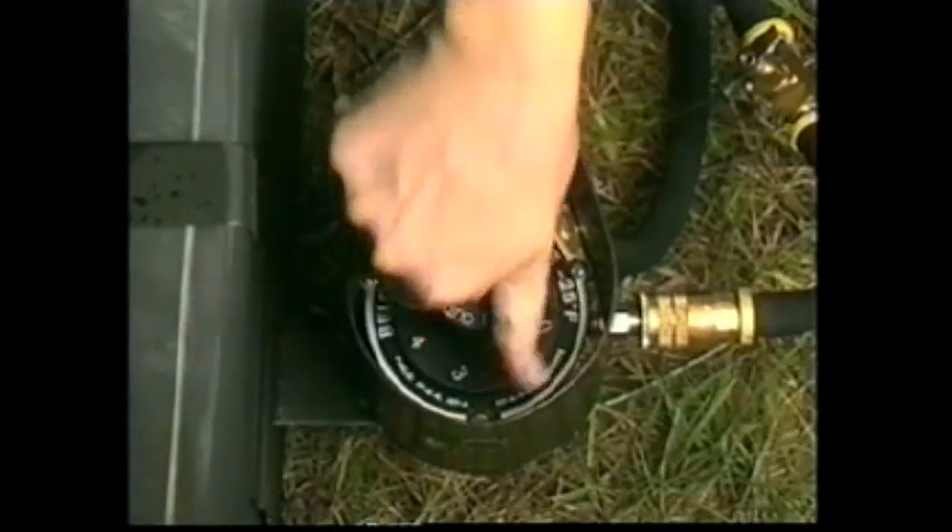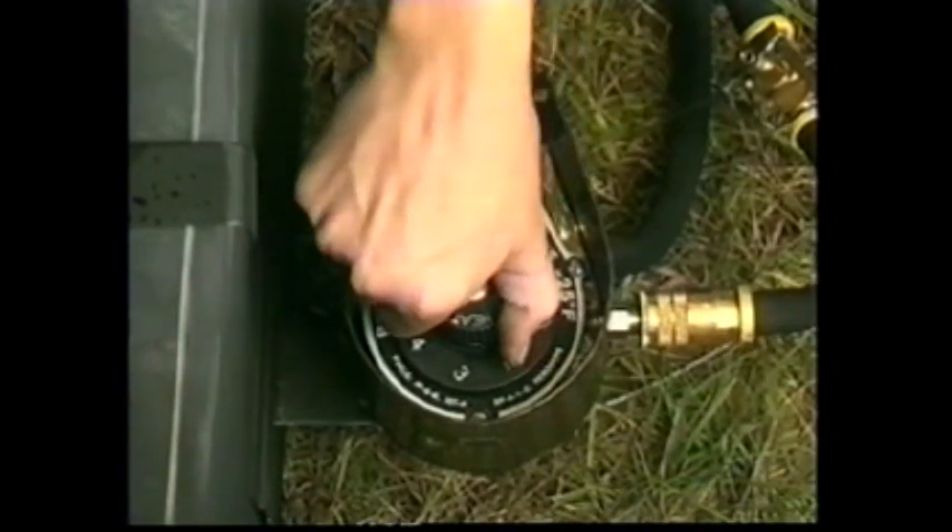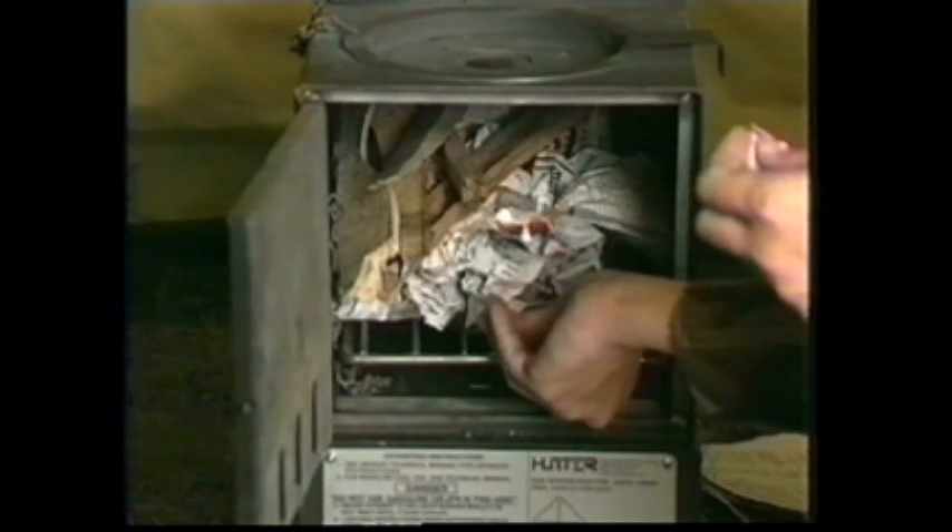Use the cleaning tool to ensure that the tissue remains at the bottom of the burner, then close the lid assembly. When the heater has warmed up and begins to give off heat in approximately five to ten minutes, gradually adjust the flow adjustment knob to the desired heat output. If using coal as a solid fuel, place five or six pieces of coal approximately two inches in diameter on top of the paper.